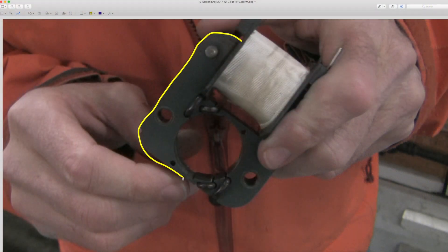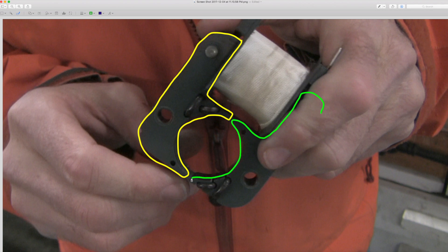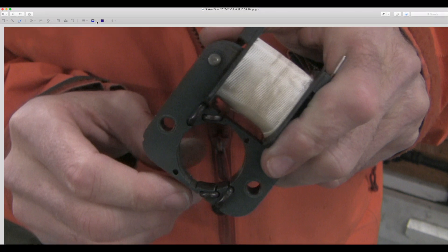Let's start with some anatomy. This motor is called a two-pole motor — I'm circling one pole in yellow and one pole in green. You can see the thick copper wires that make up the shaded poles, one on each pole, placed in diagonally opposite positions. Those wires need to be thick because they get really hot with current. These motors are called split pole motors because each pole is made up of an unshaded side and a smaller shaded side near the copper loops. The rotation of the rotor will always be from the unshaded side to the shaded side.